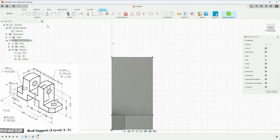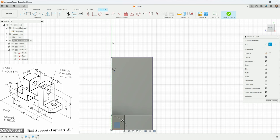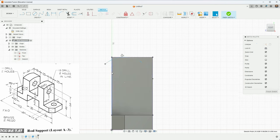On the side view there's an arc on the top right — a 35 millimeter radius arc. I'll do a three-point arc: hover to see what it's asking for — starting point here, ending point there, and the top point here. I need to add a coincident constraint to keep that connection, and make these two horizontal from each other. The main thing is making sure the radius is 35. The distance from here to here, 16, is a driven dimension automatically figured out.